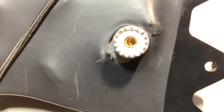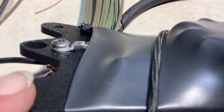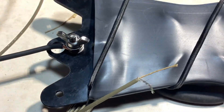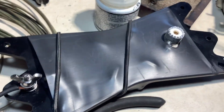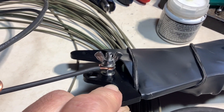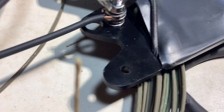Good day folks, this is part two of repairing the bazooka antenna. What I've done is taken the original wire that was broken, soldered on a little lug, and screwed that up through a stainless steel screw. I have a wing nut here as well that permits you to change the wire at any point in time. I've also upgraded to a number 12 wire — the original was an 18 wire.